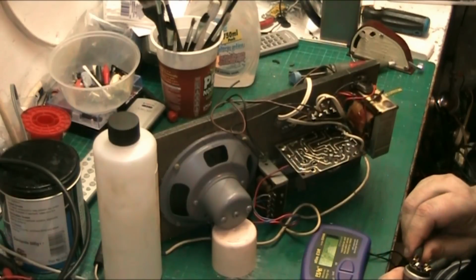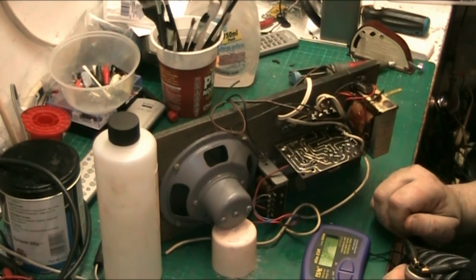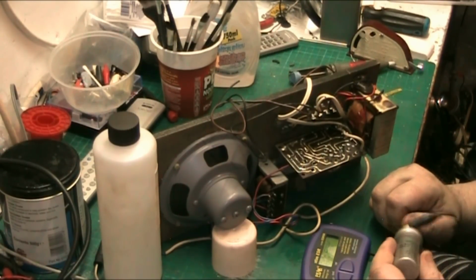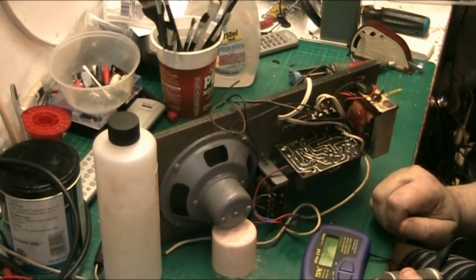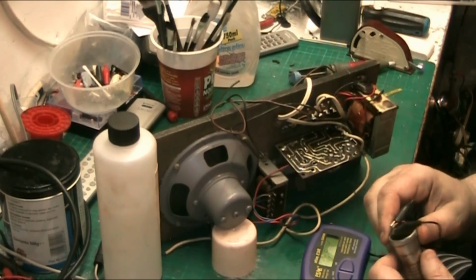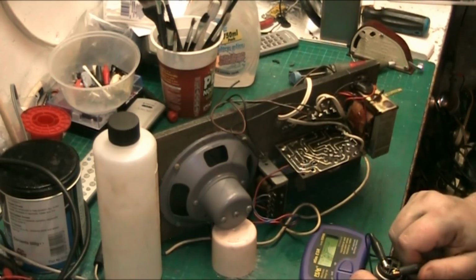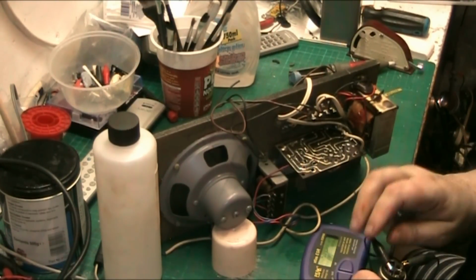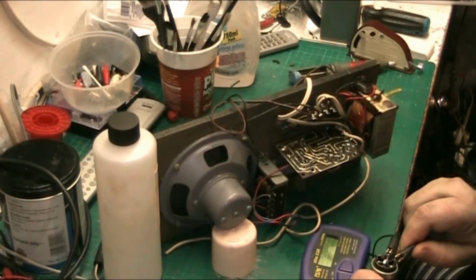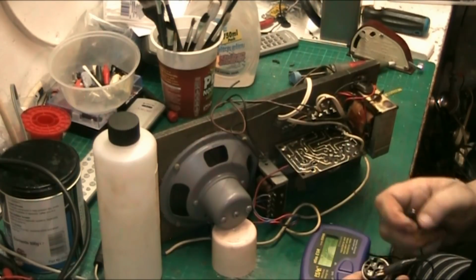44. 43. So they are a bit out, but I wouldn't want to use it. 40 UF at 300 volt working. And negative is the pin. The negative is the wide one, because that's how it went in. And this pin here wasn't used. That pin there isn't used. So it uses that one, don't use that one, that's no connection.